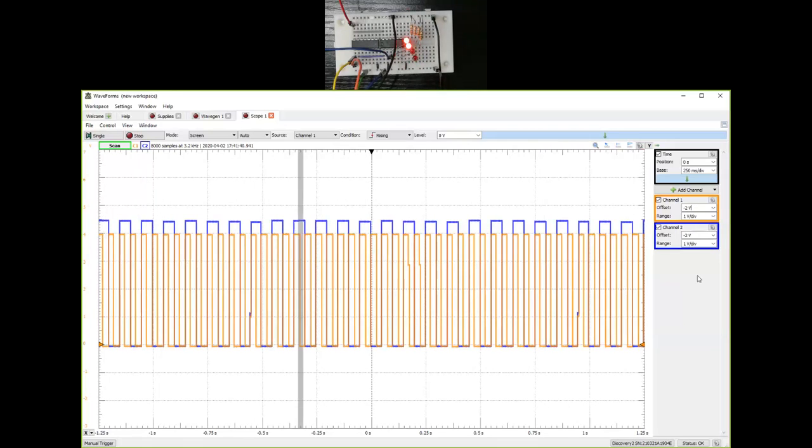And every time I move the blue channel up 1 bit, so for example if I go from pin 3 to pin 4 to pin 5 to pin 6, the frequency of the blue line should get half and half of that, half of that, half of that. So if I have the clock frequency as 20 hertz, QA is repeating at 10 hertz, QB should repeat at 5 hertz, QC should repeat at 2.5 hertz, and QD should repeat at 1.25 hertz.